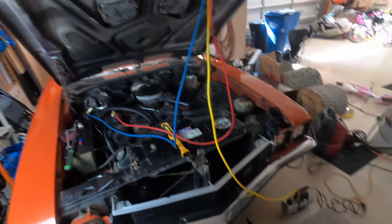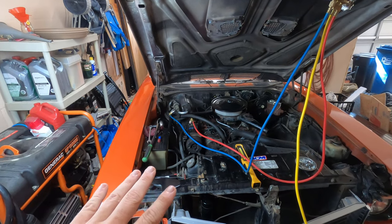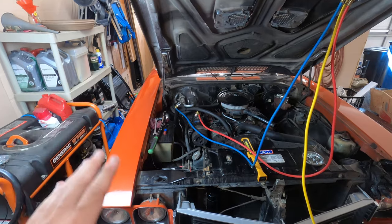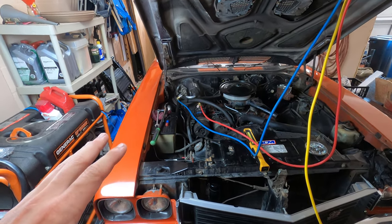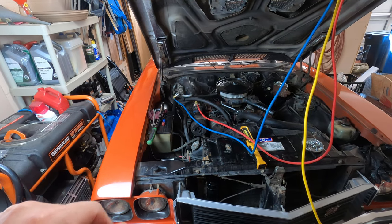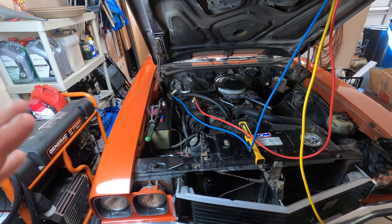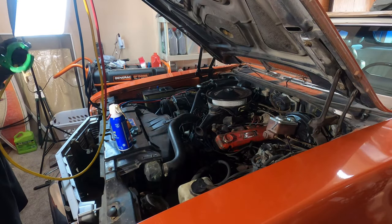The vacuum gauges are set up and the pump is running. I didn't put all the brackets back together yet in case I need to fix something, so I just have the basic system in place with all tubes connected. I'll run a vacuum for 45 minutes, then shut everything off and let it sit for at least an hour to see if it holds the vacuum. Everything's back together — let's give this a start.